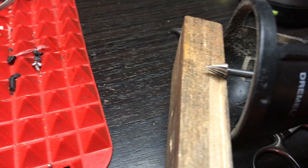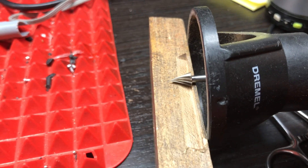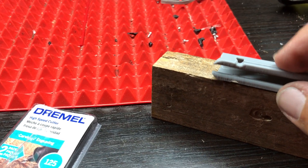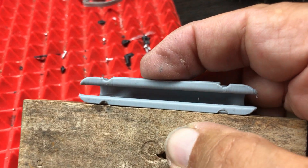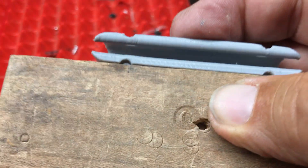You can see how this lines up here. Once you do your cut on a piece of hard wood, take your insert and test it in the groove to see if it allows your insert to line up flush with the wood. Then you know you have the right depth.